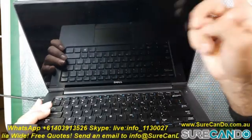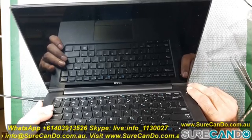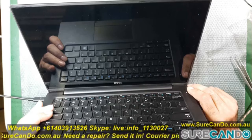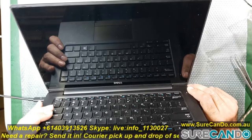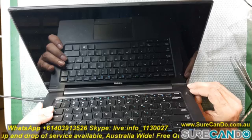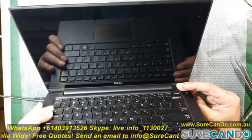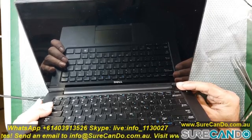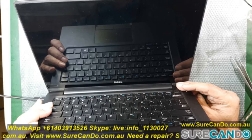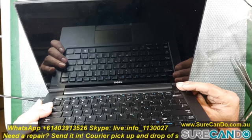It's kind of like a behavior of a motherboard where the battery is taken out for a while and it takes a while to boot. So I decided to just wait and see what happens. Because it was turning off and turning on by itself, it told me that the board is doing something, so I decided to wait longer.